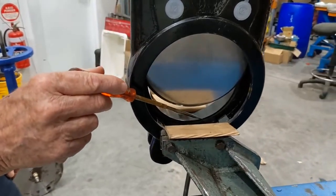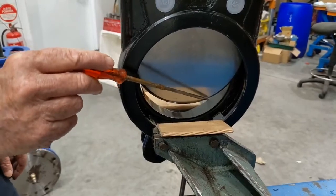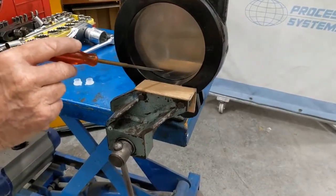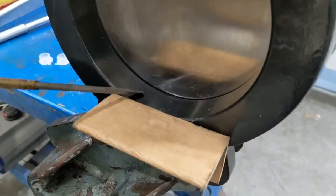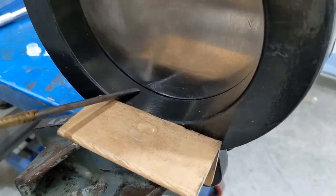That's how it gets its final seal. When you start to unwind, the blade comes away from the face slightly, which relieves the wiping action and the blade retracts. I've now closed the blade — closing the last few millimeters, you can see that blade going into the wedges on the other side, and that drives it home.